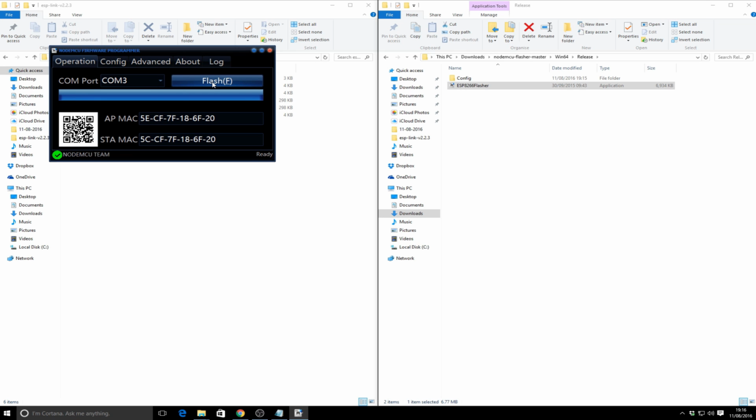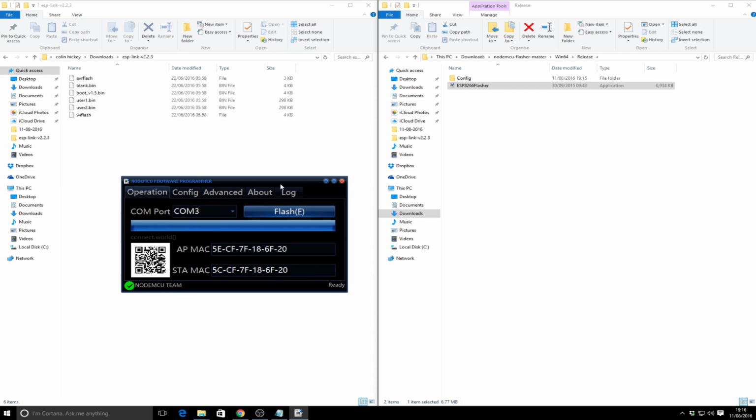So you'll notice there you've got the green tick at the bottom, and that means it's great. The bar's all the way at the end. It's brilliant. Done. Okay. What we'll do now is I'll physically power cycle the ESP8266 and then connect to it via the default page, which is 192.168.4.1 if I remember correctly, but I'll put that down in the description as well. Okay, 2.6.